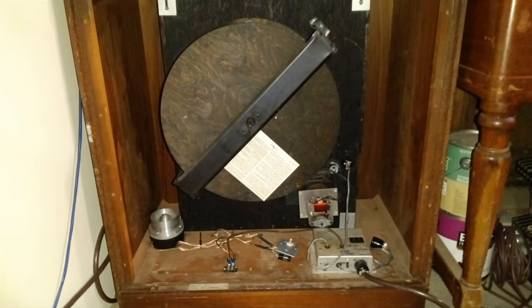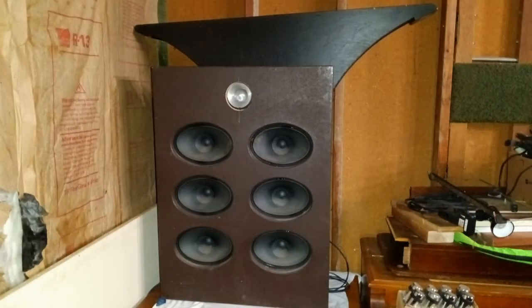On the other side we have the Leslie speaker. It did have its own amplifier in the cabinet, but I took that out because it's going to be powered by one channel of the Crown amplifier. I've added a JBL tweeter to it which just cleans up the sound — it's barely on, but just enough to make it sound a little better. Above that is another one of my M7s, and then behind that you'll see one of Rogers' exponential cones — it uses a JBL mid-range compression-type driver with a horn attached. These two speakers will work together to make a nice sound for the solo channel, which is mostly big reed stops — a really good setup that's more compact and will work a lot better with the reverb, chorus, and pitch-shifting effects I'll add later.